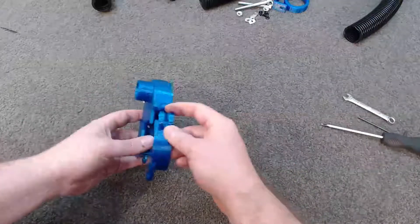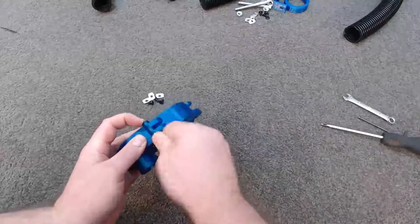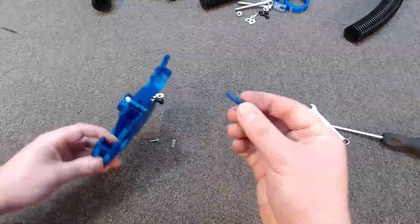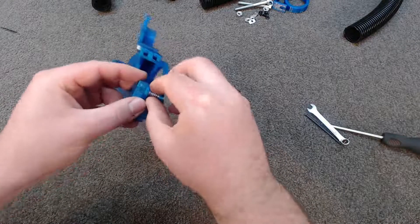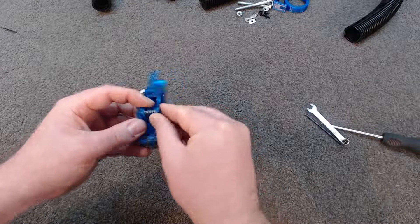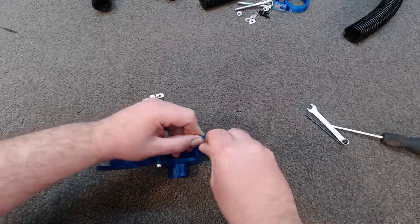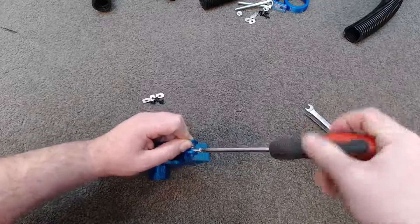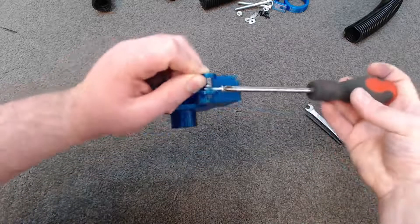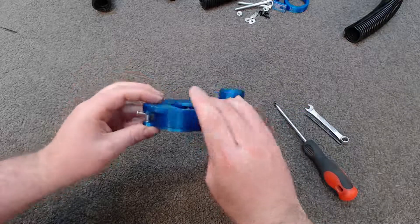I'm going to start by installing the door on the vacuum shoe using my M5 low profile cap screw. Then we take the 3D printed pin — it has a chamfer on the top — and before inserting it we install the spring, then slide the pin through the spring. We take our pan screw, pull the spring back, and thread the pan screw into the pre-existing hole in the pin, leaving just a little bit protruding out the back to catch the spring. Now we've got a spring-loaded latch — pull back the pin, release the pin, and the door is closed.